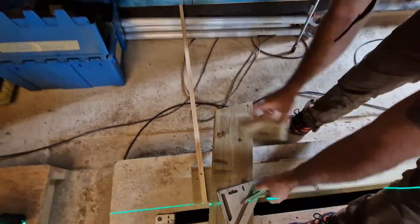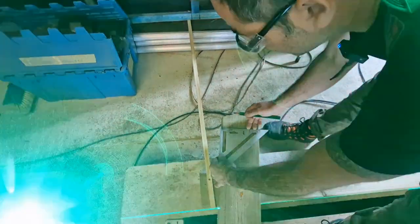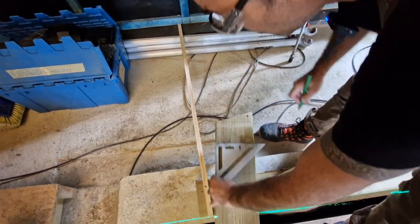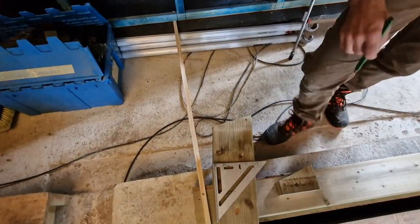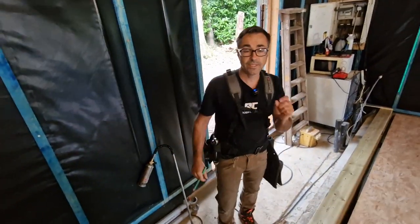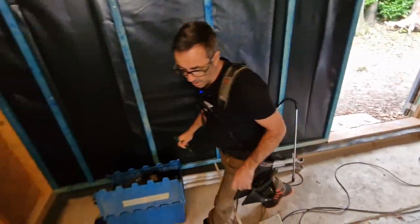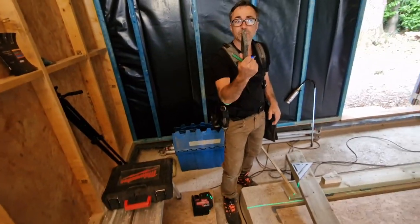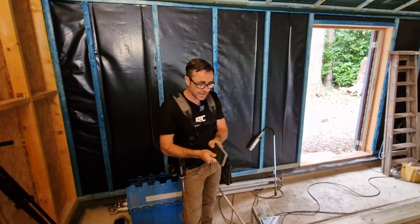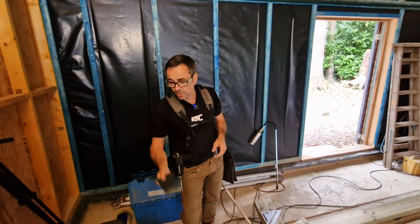And this will give us our stud length, all right? So that is our stud length. Now, underneath this sole plate that we measured from, we've already got 3/4 or 20 mil thereabouts of plastic ply here. So we know it's going to fit. Even if it was tight, obviously the plastic ply can just reduce and that can become the shim underneath.